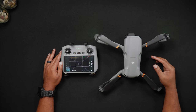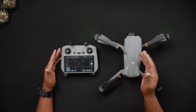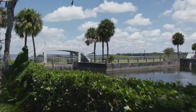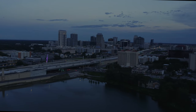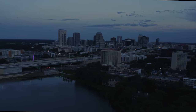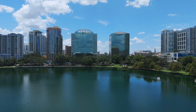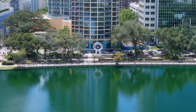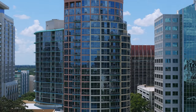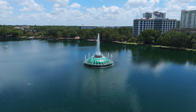Regarding the IMU calibration, the job of the Air 3's IMU or inertial measurement unit is to ensure that the Air 3 is level and stable in the air. It does so by monitoring the drone's velocity, angle, force, and attitude. To monitor these, the IMU checks the Air 3's accelerometer, barometer, gyroscope, and thermometer. If any of these systems are out of whack and not corrected, the Air 3 could tilt while hovering, have difficulty remaining steady and stable, or even display signs of difficulty cooling down. By calibrating the Air 3's IMU, preferably when prompted, you can reduce sensor errors and have an overall better flying experience.